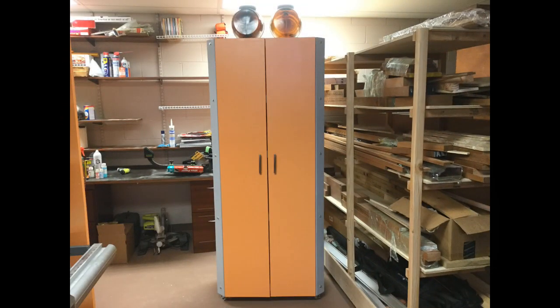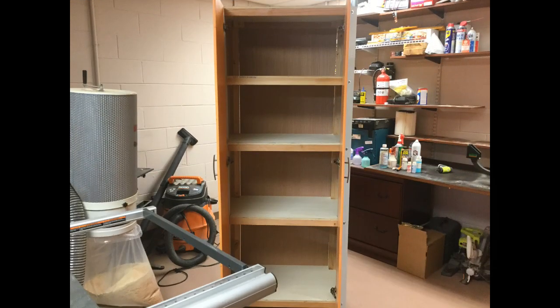So here it is — here is an example of a storage cabinet that I built using this system. It is 6 feet tall by 30 inches across and 18 inches deep. I elected to put doors on it, although there is no reason why you have to. One of the characteristics of this system is you can make these cabinets just about any size you want — the only thing that changes is the dimensions of the plywood after you cut it to size. I have made cabinets 4 foot by 2 foot, and cabinets 1 foot by 4 foot. This one is 30 inches by 18 simply because of how large I cut the plywood.